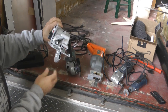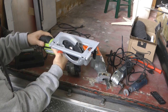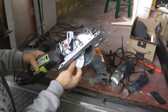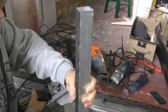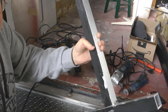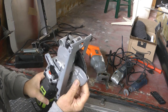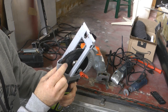This is our miniature circular saw, which resembles the larger circular saw in many ways. Where I use this is when the depth of the cut is very important. For example, I had to cut the structure — this is our quarter-inch tube — and this will cut all the way through one of these tubes with a single pass. That's really nice if you're cutting out a section of wall that has tubing behind it. Using the proper blade is very important — you want lots of teeth, and it helps if the blade is marked for sheet metal.